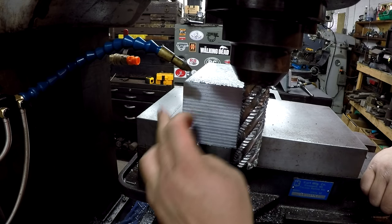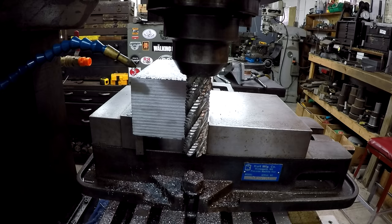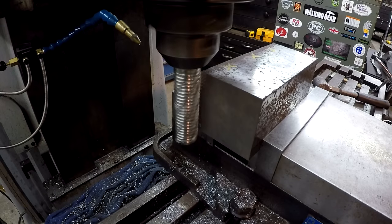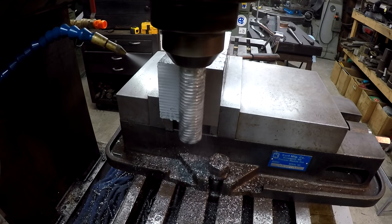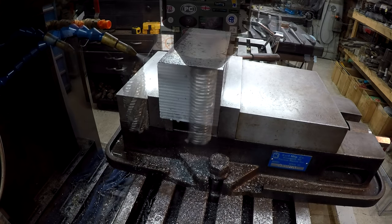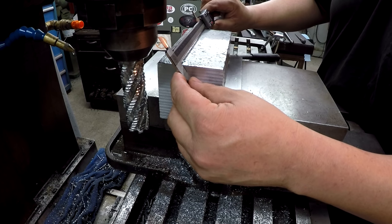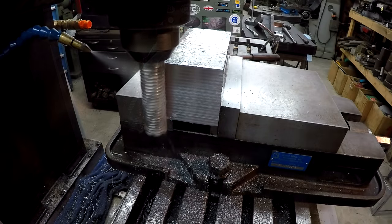That was water drops and chips right there — that did just fine, didn't make any noise, did pretty good. We'll flip it around and do the other side. Here we go on the other side — I'm going to take a cut, measure it, and then take a final cut. This is about a forty thousandths cut right here. We've still got forty thousandths — I'm measuring seven point one six five, so I'm taking it to seven point one two five. That's a faster feed — I'm at three point six inches a minute.